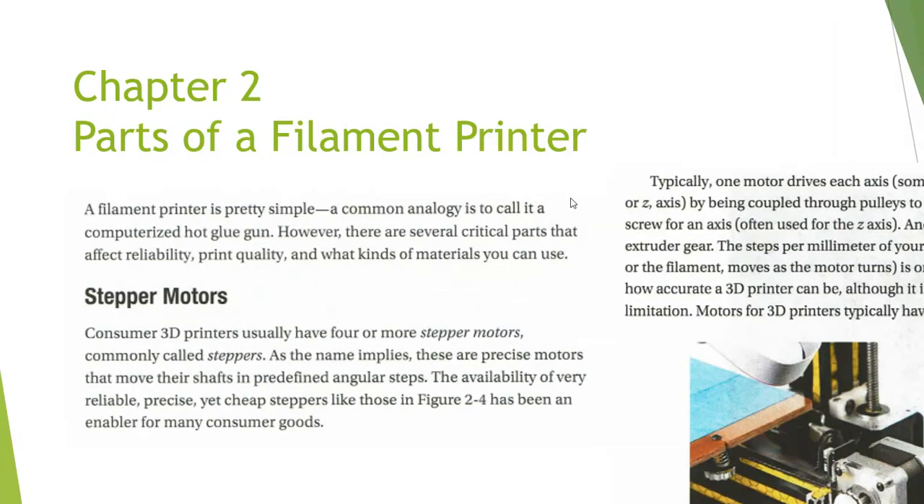There are a number of parts involved in 3D printing. A lot of times people will call it — it's sort of like a hot glue gun as an analogy. It extrudes the plastic through a hot nozzle one layer at a time. What controls the nozzle placement is the stepper motors — we have precise controls for the X-axis in a Cartesian coordinate system. Here's our Z-axis. Those are controlled by what's called G-codes, which are generated by the slicing software. They provide the toolpath for the extruder to deposit the plastic material layer by layer.